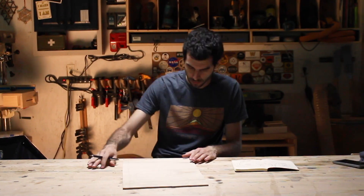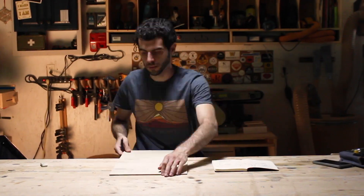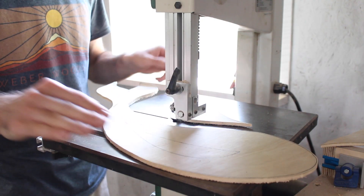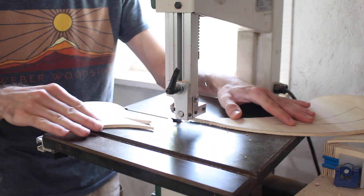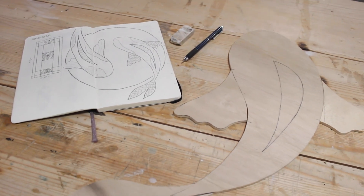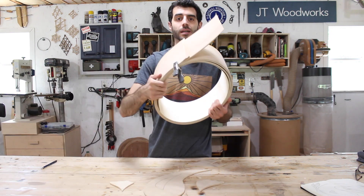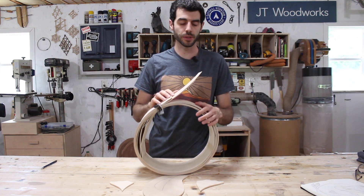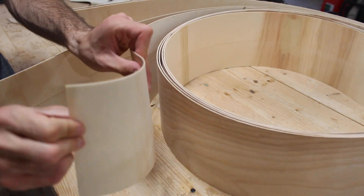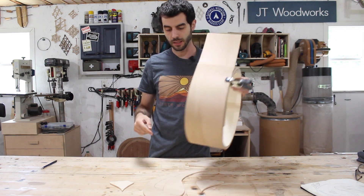I have a sketch of what the final piece will look like in my sketchbook, but I needed full-size pieces of the koi so that I can use them as templates. I transferred my sketch onto a piece of plywood and then cut out all the individual pieces of the koi on the bandsaw. All the pieces of the koi fish form are done. Now I need the strips that are going to go around it to create the actual koi fish, and for that I'm using this — cut off from another project where I needed half inch plywood but only had three quarter, so I resawed the plywood and ended up with these thin strips. These are a little too wide so I just need to cut them down and we can start making the koi fish.